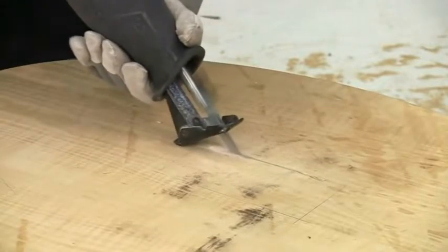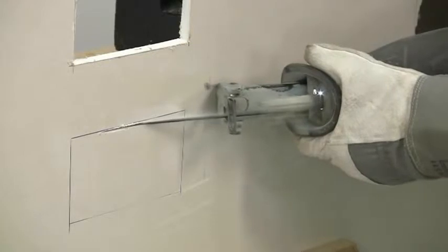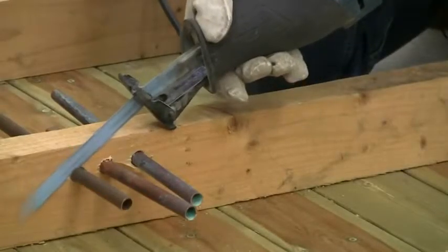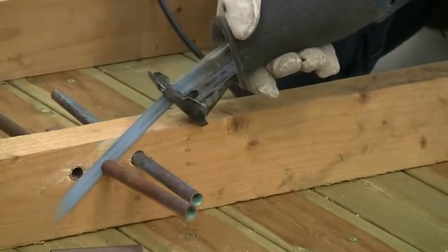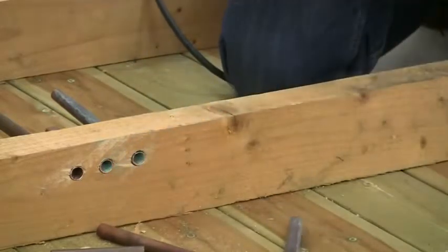For internal openings, such as in decking or plasterboard, you can make plunge cuts much as you would with a jigsaw. For flush cuts, in this case with projecting pipes, use flexible bimetal blades and just apply a little lateral pressure keeping the foot plate tight against the wall.